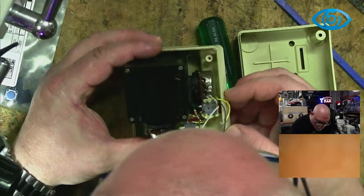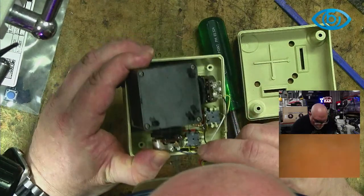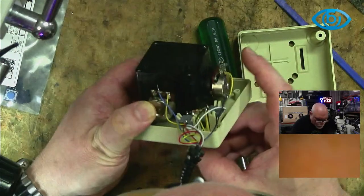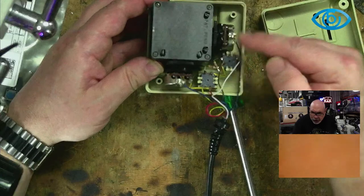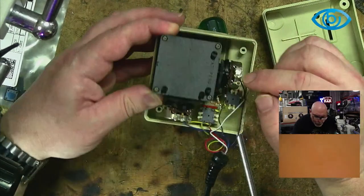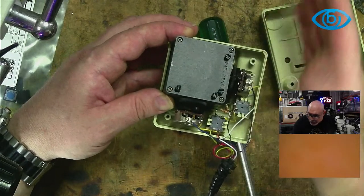Right, so let me have a look at this now with my magnify eye. So there's a yellow wire here. It's been soldered to the red wire here. And then just stuck on by hand to this here. Now this is the adjustery part. So what we have here and here, they're some potentiometers, also known as pots or variable resistors, and they are part of this mechanism here. So this is where you make adjustments to where the center point is.